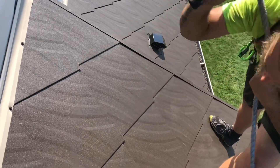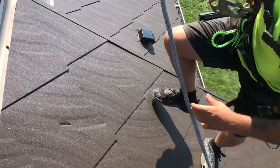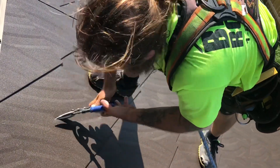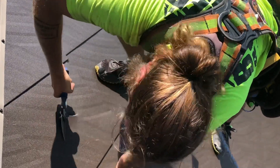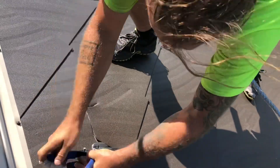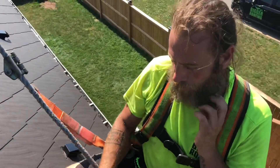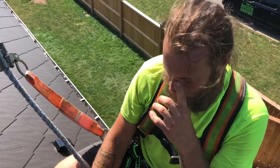We're starting by putting a hole in the shingle. Almost breaks your heart doing that, doesn't it? Now since you have a rotating fan inside this vent, you don't want any metal sticking up, so you're gonna want to make your cuts as clean as possible.